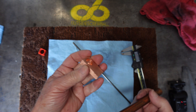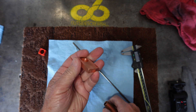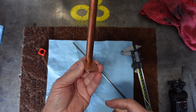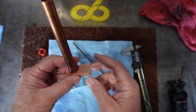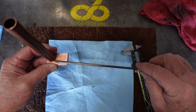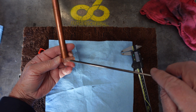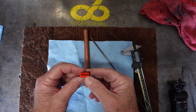The copper scrap actually already had a wedge shape in it from something I'd made previously. I cleaned it up on the mill and then bored it for the copper pipe to go down into it. So that would be my fluid inlet coming down — this would be the manifold. Now I've got to drill the feed tubes all the way back through, and I'm going to put them in this face here — one, two, three — keeping the spacing similar to what I did on the prototype.